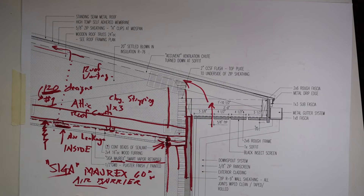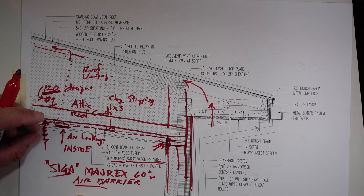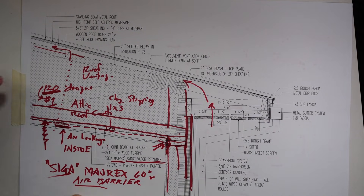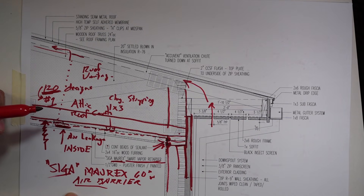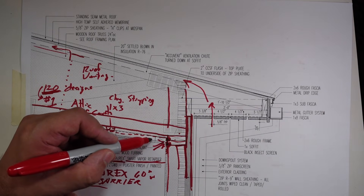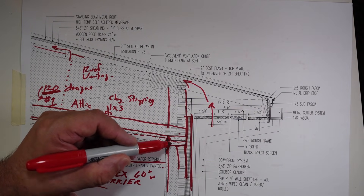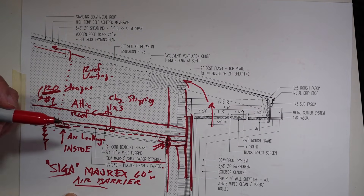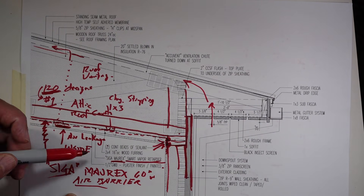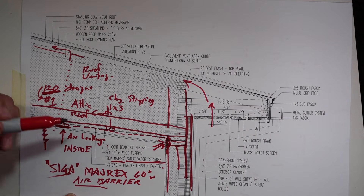It's a flexible air barrier, so these guys aren't putting up heavy sheets of stuff — it's basically a very light membrane paper type material. And again, it's only 60 inches wide. You basically roll that out across the ceiling and get to the other side, run those two beads of sealant, drape it over, squish it in, staple it off, staple it up, tape all of the joints, and we basically have what I would consider an inverted bathtub — that is our effective air barrier.